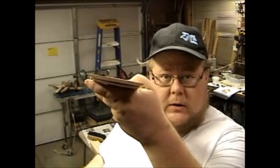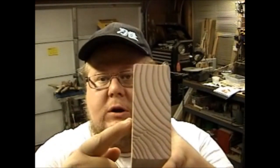Probably the best way to shave off the tops of the 2x4s was to use a table saw, like the one you see behind me, over here somewhere. No, over there, off camera. But since I haven't started using the table saw yet, but I really do know how to use a bandsaw, I ended up setting up a rip fence on the bandsaw and shaving one side of the entire length of the 2x4. And since this is going to be the inside of the box, the cut doesn't have to be pretty. I can sand it flat enough to be fine, and I still have the radiuses on the other side of the board for the original look that I was going for.